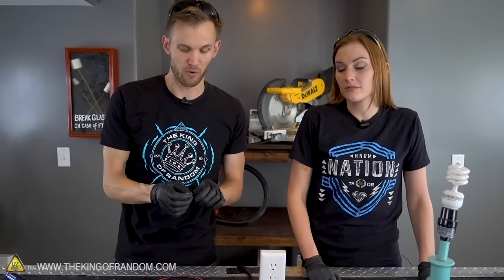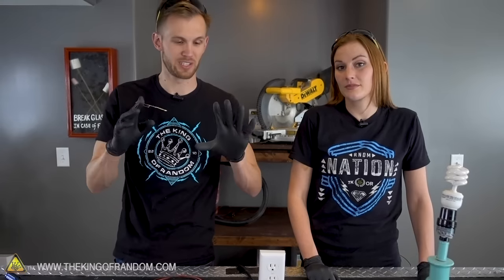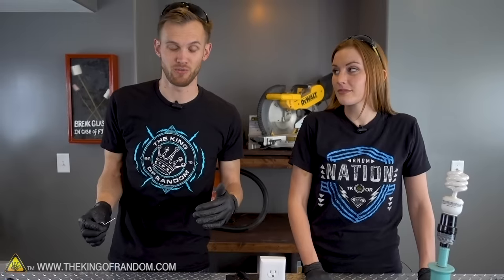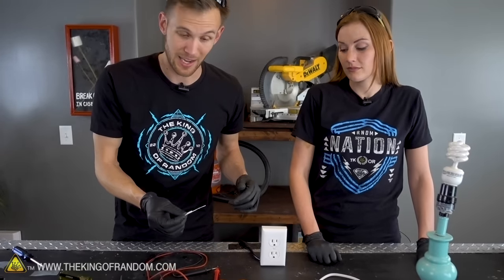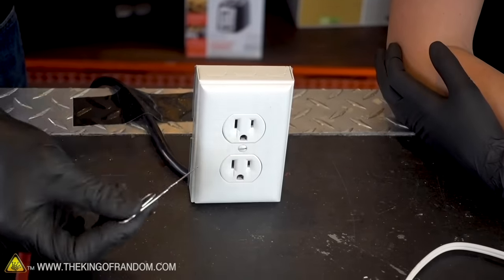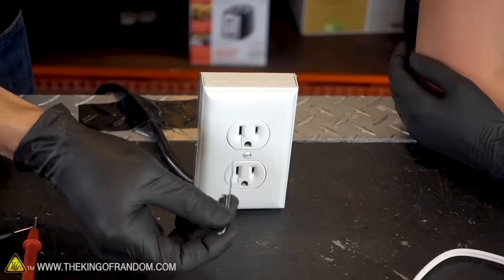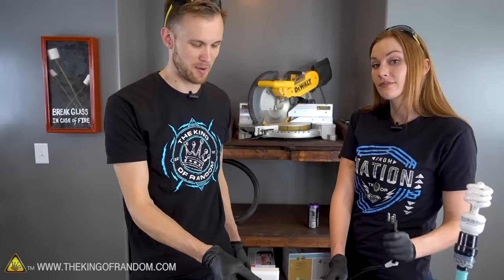However, you could be grounded. Currently I'm wearing shoes with rubber soles and rubber gloves, but they are kind of thin rubber gloves, and I don't know exactly how conductive my shoes are. So it's possible that if I put this into the hot side of the outlet, it would zap me. Although, I do feel fairly safe putting it into the neutral and the ground side, and I'm even going to try that right now. Doesn't seem to be doing anything to me — I'm not feeling it. Ground, neutral, nothing's really happening there. With the outlet unplugged, I've now fit this paper clip into the hot side, and now we're going to plug it back in and do some more testing on it — not by grabbing it, though.